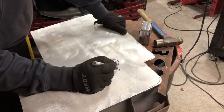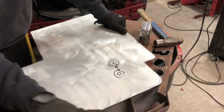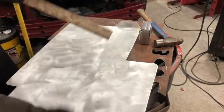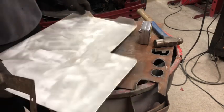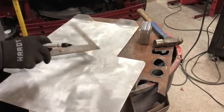Then you're gonna wanna space these out evenly, of course, a nice even spacing. So I decided 3 inches on center. The hole for that dimple die is 1¼, which leaves you with 3/4 of an inch, 3/8 on each side, to be safe. Or no, more than 3/8, sorry, I'm off. But there is a good buffer. So back to what I was saying.